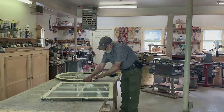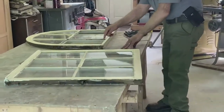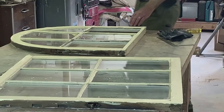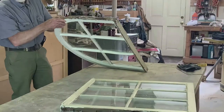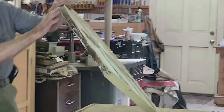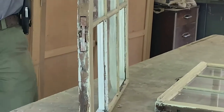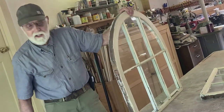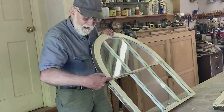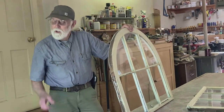Where it's open a little bit I'm going to squeeze it together and put a dowel here, put a pin here, and try to glue it. The key that holds this joint together — it's an interesting piece. You can see the handiwork on the curves and the three pieces. It's called the key and it's right there, driven in.